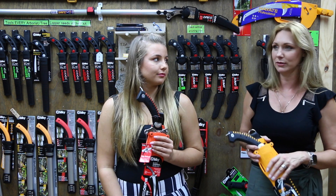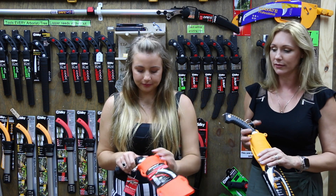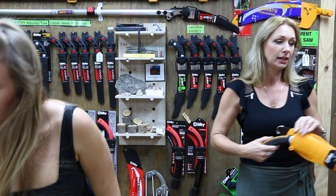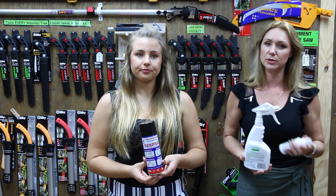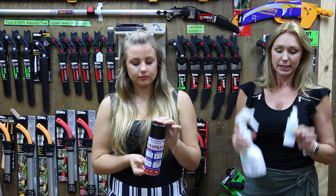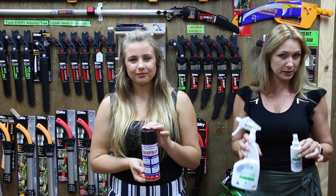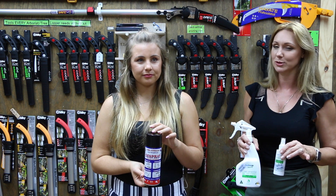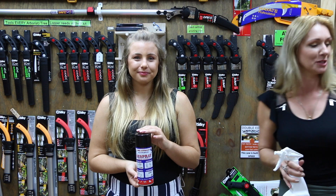For cleaning: we say it in nearly every video — make sure you clean your saws. The blades have a hard chrome plating or coating to protect them and prevent rust, but Australian tree saps are very acidic and corrosive and will eat through that. Please clean your saws after use and spray them with a lubricant. We recommend lanolin and sheep oil — lots of brands available at hardware stores or chainsaw and mower shops. We also recommend a specific natural cleaning product for cleaning the saws.